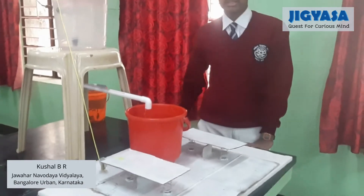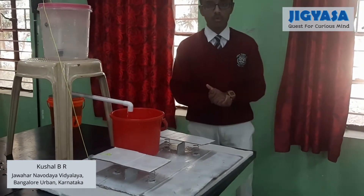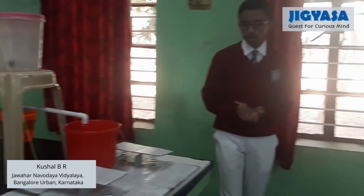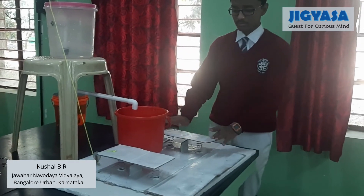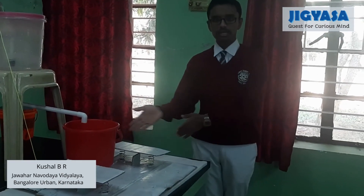This is the working of our system, and it works in all conditions, from a small baby to a person who weighs more than 100 kg. We do not have the problem of corrosion of springs because we are using zinc-coated springs, and the instability of the springs will be managed by side molding beside the footrest to cover and secure it properly. As this is a prototype model, we have not completed the molding around the sides.